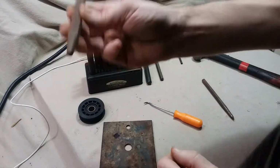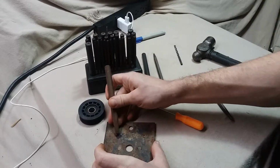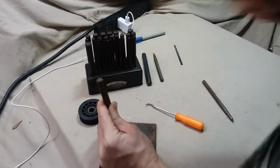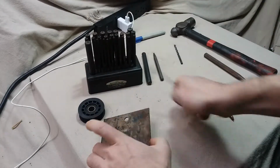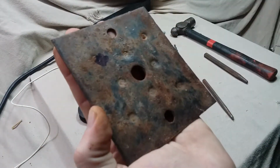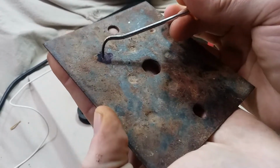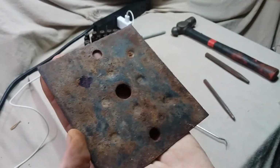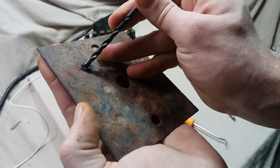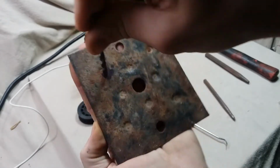And then if you go up the chain to larger center punches, we can increase the usable diameter of that point, which we can then take a center drill or a drill bit, and the point of that, give you something to hook up into.